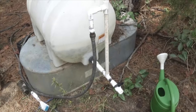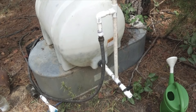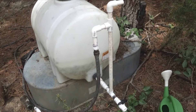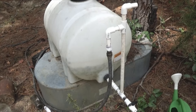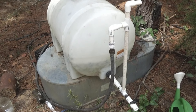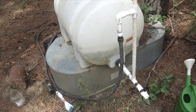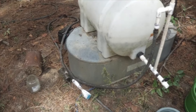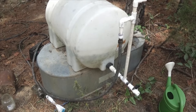The water flows so very, very slowly that there's no concern whatsoever with this section right here being damaged because of water flow. You can do the math: 729 cubic inches times 10, divided by 60 times 24 — that'll tell you how many cubic inches of water I'm moving in an hour. It ain't much. It's about a quart, something like that — actually, I'm not even sure it's a quart. It just is not very much water.